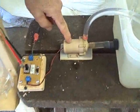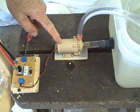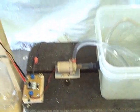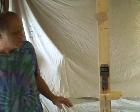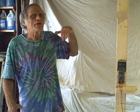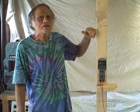This is a 12 volt DC pump and it could be used with a photovoltaic system, where the voltage changes as the sun changes. We're going to be testing this at a voltage of 8 volts because the flow rate will change depending on the voltage. The two most important points of performance are the flow rate at a height of zero and the head pressure — the highest column of water the pump can support at a flow rate of zero.